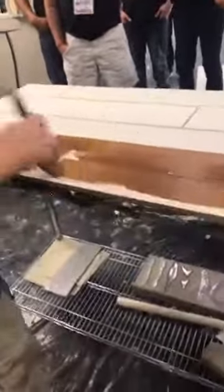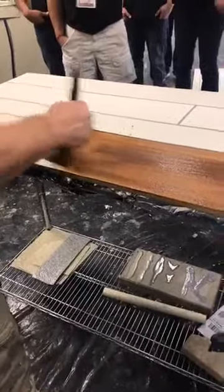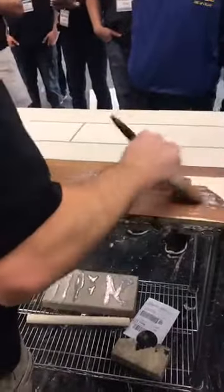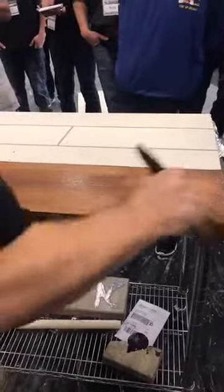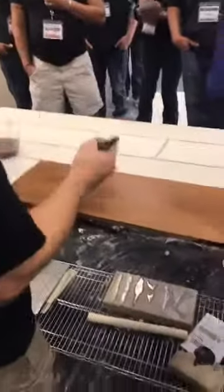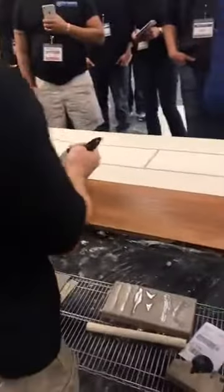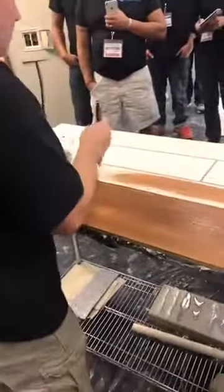What I'd normally do is coat the plank to begin with 100%. You could spray it, but you'll have a much better realistic look with a brush texture. A lot of times after I get my plank coated like this, I might run my brush this way through it, long ways. Whenever I deposit a little bit of stain like this, wherever it's puddled, it's leaving a little bit of a darker wood plank line. I don't care if I did a little bit of splatter here — just a slight bit is not bad.